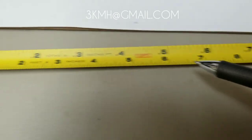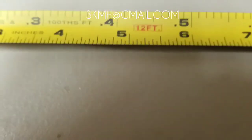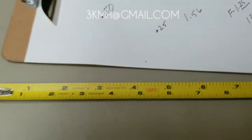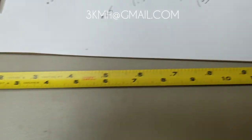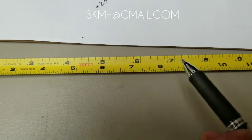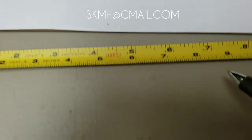Or at least take a picture. You can take a picture of a pocket tape — I'll hold the video like this for a bit. Take a picture of it, and then that way you'll be able to see exactly the layout of our engineer's tape. It makes no sense for us to convert our work into inches when all the information we're dealing with is in hundredths of feet. The only time we ever convert into inches is with the architect's plans — if there's a grid line and the dimensions are given in inches, then we have to adjust our measurements to fit. But that's really the only time I've ever seen any type of conversion.